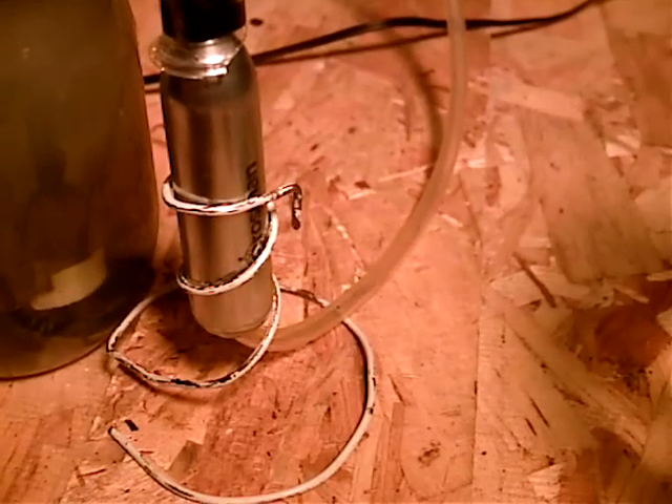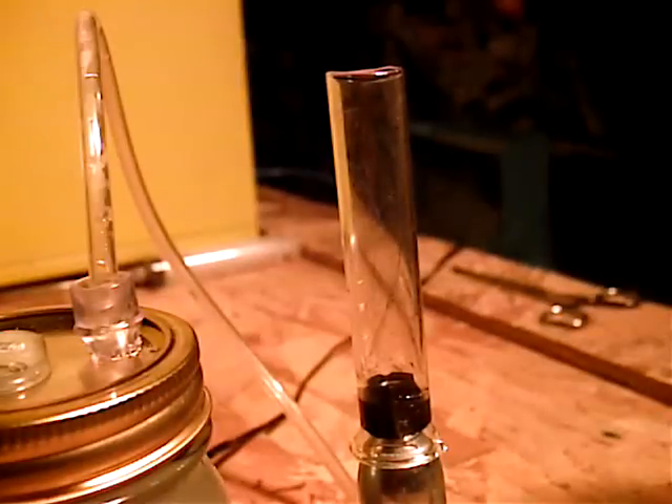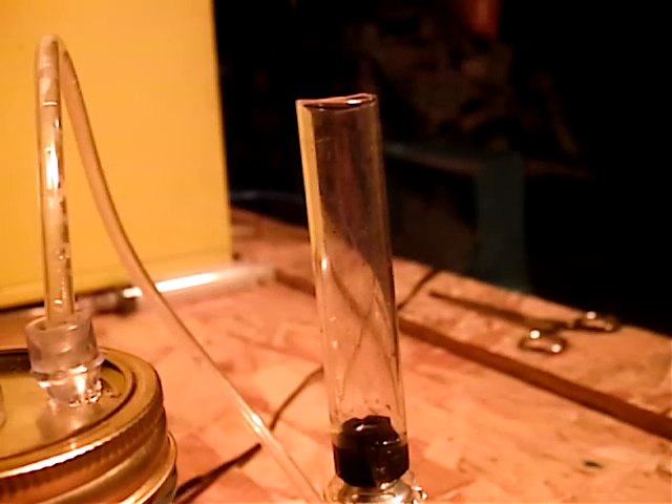We can already see that it's starting to bubble down there. You can see the water moving at the bottom of the tube, showing that it is forcing hydrogen gas. This takes about a minute, minute and a half, maybe two minutes for the initial hydrogen gas to prime up through the tube and push all the ambient air that was in the system before you started. You can already see it's starting to turn greenish-gray. The poorer quality steel you use, the more you're going to get of that.